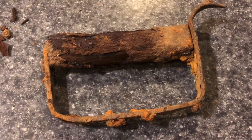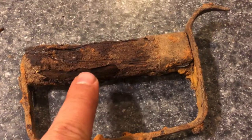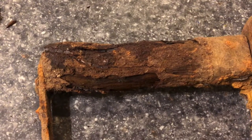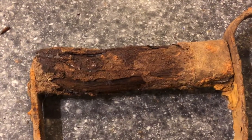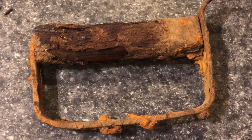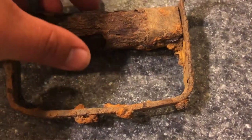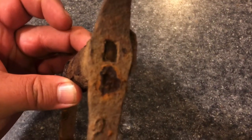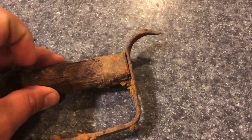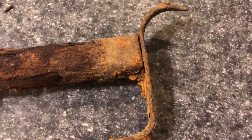Here is the D-guard. You can see this is what's coming off of it. The wood actually feels a little bit solid inside, a little more solid — just the outside is deteriorating. I did soak some super glue into several of these crevices trying to keep it together at one point, so some of that has soaked in and hardened things up. The guard itself is pretty rough. It's going to take some electrolysis — it's got some pretty good-sized pitting in several places. I was thinking this might have been brass, but I'm thinking it's not now. And it is cracked.